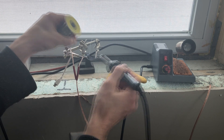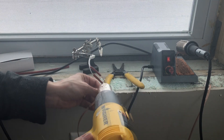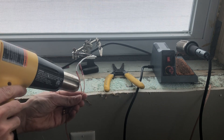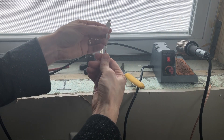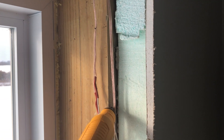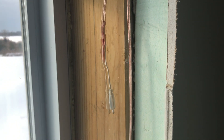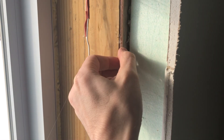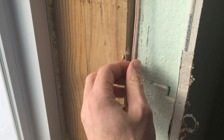Just put a little solder on the joint and fold it over. Slide the shrink tube up and then use a heat gun to shrink the tube on. Now I have two nice staggered connections with shrink tube over them, and we shouldn't have to worry about that coming apart. Now I can just run that up the wall and it'll be hanging there for when I go to connect the blinds. I'm just using a little bit of hot glue to set the wire between the jam and the foam so that when I put the trim in it won't get caught, and that also makes sure that I don't run screws through the wire accidentally. So a little hot glue every few inches up and down the wall to make sure that it'll be in place.